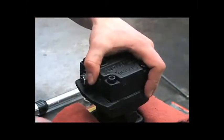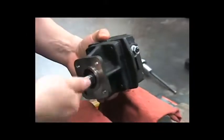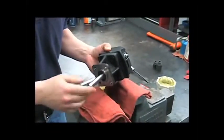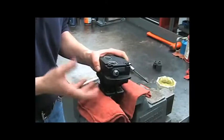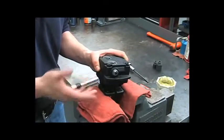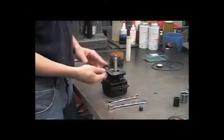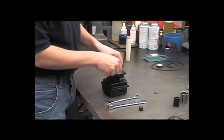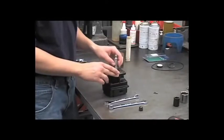After that, you'll want to turn the shaft at this point. Make sure that everything turns nice and free. If it feels bound up or you hear grinding sounds, you want to disassemble the motor and look for any damage or debris inside. Now we can reinstall it onto the wet end of the pump. Next, we'll put that slinger ring back onto the motor shaft. Make sure that the shaft is free of any oil — if necessary, clean it with alcohol. You want to make sure the shaft is totally dry.